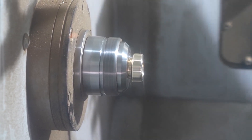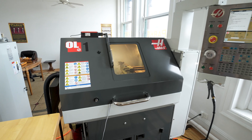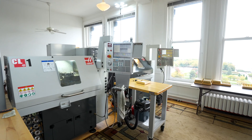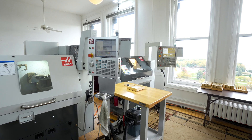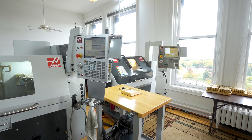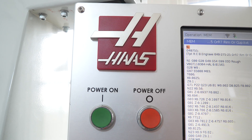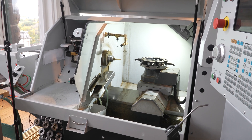One advantage for me about these machines is they're all single phase 220, all rated at 20 amps, and they don't have any hydraulic systems. Right now I've got all three of these Haas CNC lathes on their own 20-amp breakers, all feeding together into a 50-amp single phase circuit. Runs great — never had a problem, never a low voltage situation, never an alarm. I can even put my air compressor on the same circuit. I've never heard of three industrial quality CNC machines that can run off a single phase 50-amp circuit, which means you could do this anywhere.